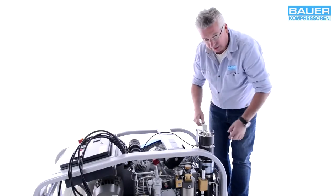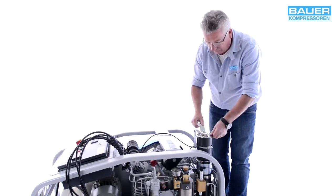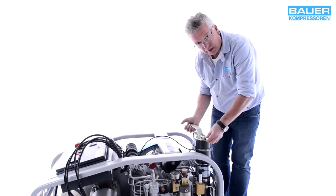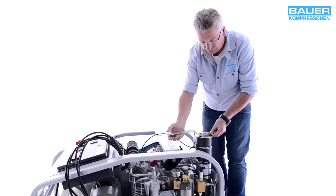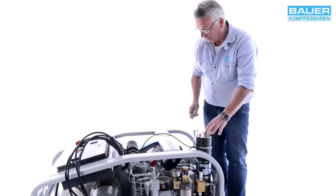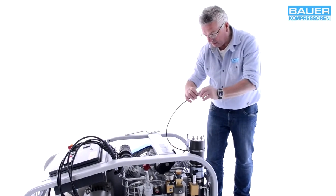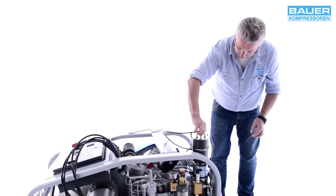Once the cap is in place, turn it a quarter or half turn clockwise again to ensure it is not too tight. Once it is seated, turn it back a quarter to half turn anti-clockwise so that the cap does not seize on the housing. Now reconnect the Securus sensor using the coaxial connector.